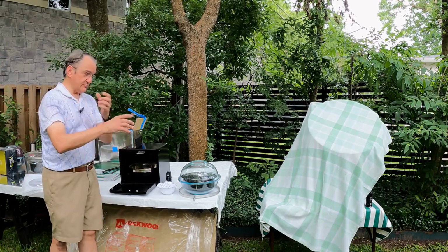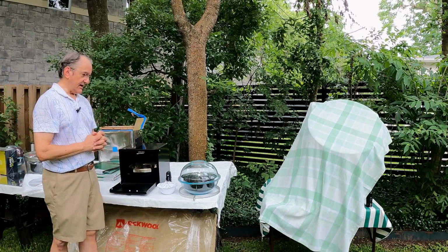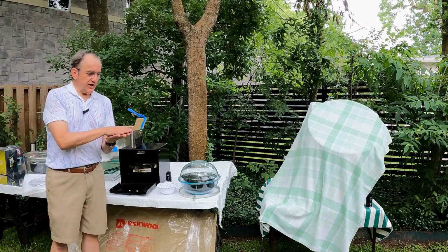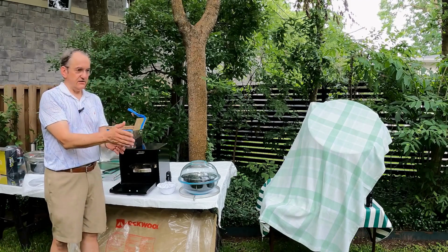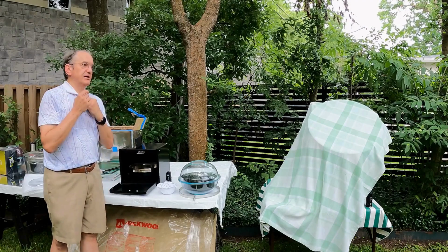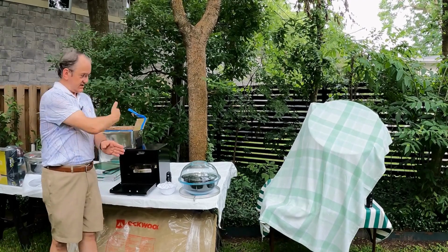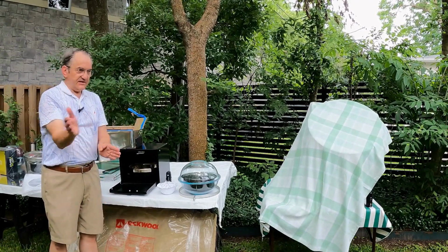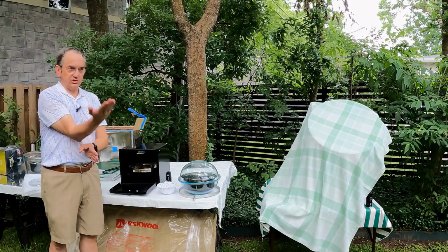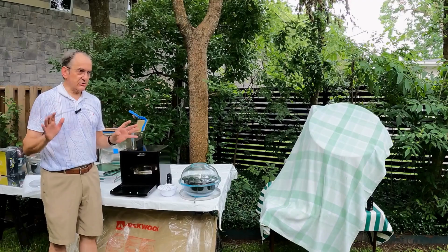Stan sent me one of his trackers, which I've taken apart and reused on a couple, and that was the last one on Tom Hallquist. So the way Stan does his cookers, it's 2 axis, because generally when you're tracking the sun, there's altitude and azimuth. The same thing is true with telescopes. If you buy a telescope, they often have what they call altitude and azimuth, which is this rotation. It has 2 different motors and 2 different axes that it's tracking. One is just up and down, that's altitude, and azimuth rotates. So that's very common, works great.